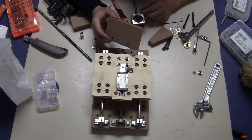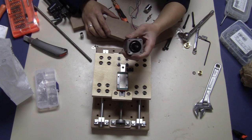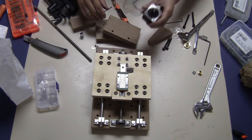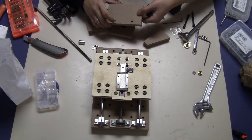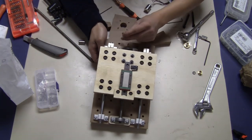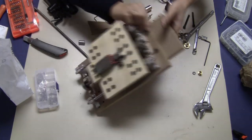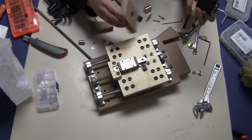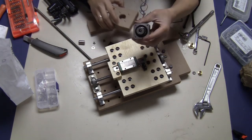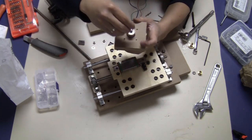The next step is to put together the stepper motor mount for this Z-axis. I don't need a really big motor — I'm only using a NEMA 17 because this is a really small axis and it doesn't have much weight on it. I have these four pieces; first I fix them to this plate using two 45mm M6 bolts — just tighten by hand for now. Then install the stepper motor on this piece, first fixing the coupler on it, then slide it in and use M3 25mm bolts to fix it down.